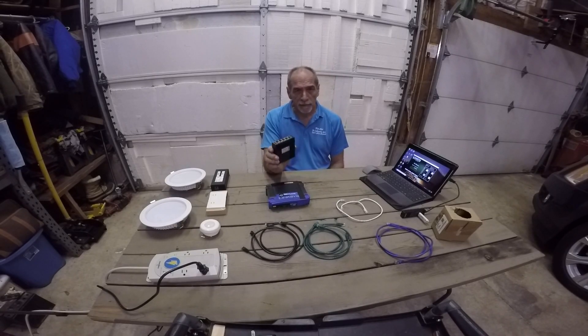I had to pick up a Type 2 PoE switch. Type 2 is different than Type 1 — it really depends on the wattage. Type 1 is a 15-watt output, Type 2 is a 30-watt output, Type 3 goes up to 60 watts, and Type 4 is going to go to 100 watts.